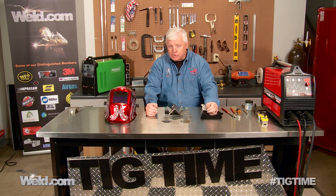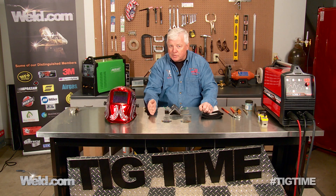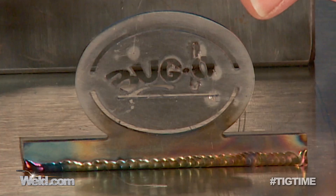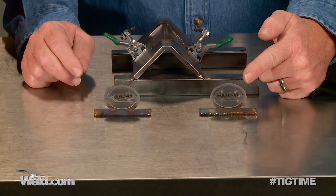Let's recap the two samples. Both of them are absolutely fine structurally — it's 304L stainless steel. This sample I did with absolutely no pulsing at all: 50 amps, travel speed about eight inches a minute. You can see it's a smooth weld and comes out a little bit darker. This sample I turned the pulser on — one pulse per second, background current of 35, going from 50 to 35 back and forth. You can see it gives some fantastic results: a ripple effect and actually a little bit better color. You can choose which works best for you.